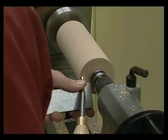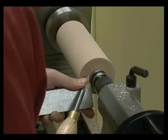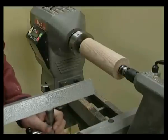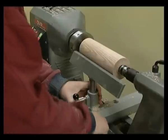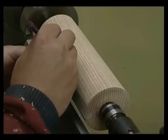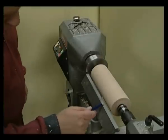Now the detail can be turned — this being a shallow cove approximately an eighth of an inch or three millimetres from the outer edge and inner hole. Switch off the lathe and check for a clean smooth finish. Once you are happy with this, return the tool rest to the safe tool rest position along the length of the wood. Now place three marks at one and a half inches or 37mm, five and a half inches or 140mm, and six and three quarter inches or 172mm from the trimmed face. Switch on the lathe to complete all three marks.